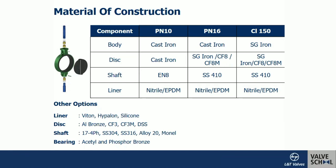The shaft — the stem — is made of low carbon steel, martensitic stainless steel SS410, or similar materials with good torque resistance. The liner is very important as it gives the butterfly valve zero leakage. The soft elastomer material could be low-acrylonitrile nitrile, high-acrylonitrile nitrile, EPDM, or others.